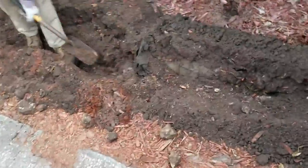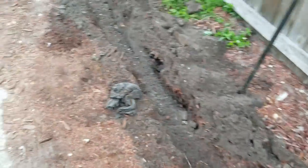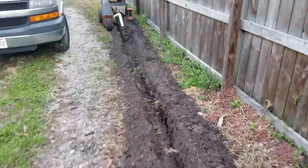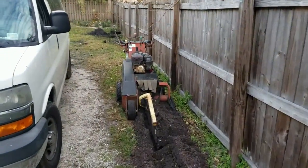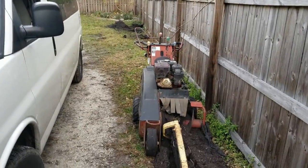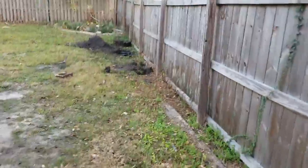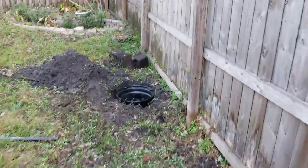We had to trench through some of the old driveway - you can see the old bricks and stuff down here. Good thing we had the trencher; you can see where it's cut through great big stone. You definitely need a trencher on some jobs. You could do it by hand with a pick, but they're just cleaning out the debris here. We're going all the way back to the back where you see the mound of dirt - that's where the sump basin is going to go.